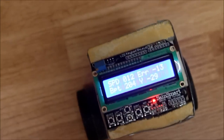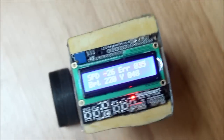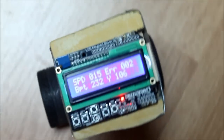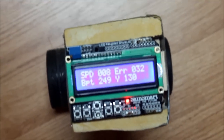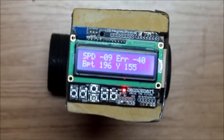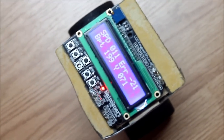SPD is an integer with a theoretical range of plus or minus 0 to 255. To its right is the ERR, or error reading — previously referred to as the all-time running error. It can be any integer value, but 0 is considered ideal. On the bottom row is the BPT balance point reading, shown as an integer but interpreted as a decimal value of degrees out to the hundredth position — it's the set point that the pitch PID would see as needing zero correction. Finally, to its right is the Y, or yaw, reading in degrees, updated once per second, while the other three are updated every three-quarters of a second.